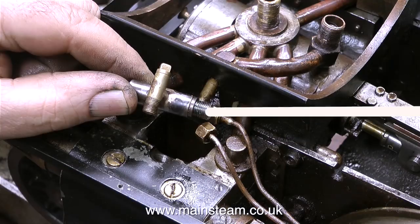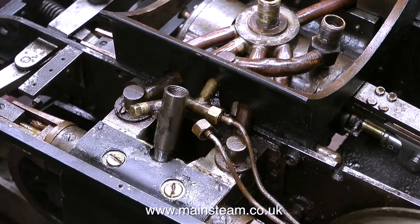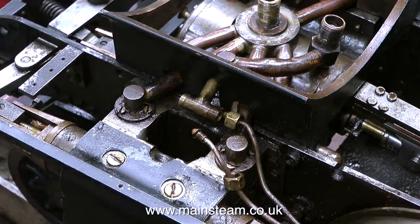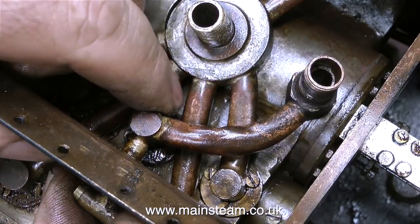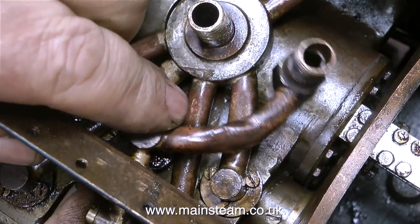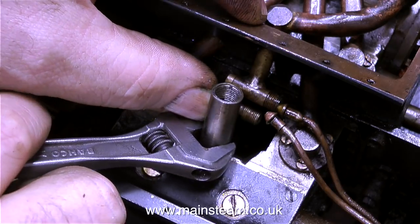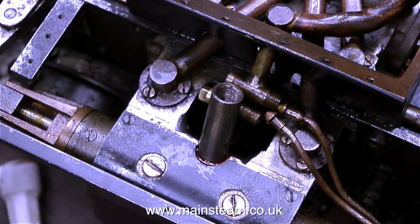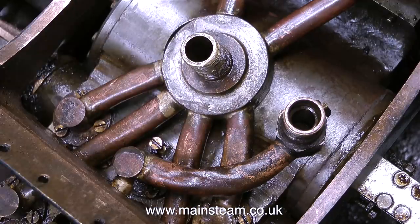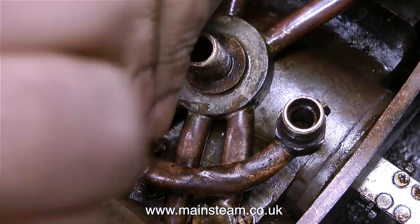So how did I repair the fitting? The original thread was a little bit on the thin side. As this part is made of stainless steel, I also made the new thread out of a piece of stainless steel. Unfortunately, to fit this new part into the cylinder, I had to remove the pipe that feeds the centre cylinder, because this was in the way. Once the centre cylinder pipe could be moved out of the way, I could get down to the serious business of fitting this new replacement part into the hole in the cylinder. Then, as assembly is the reverse of disassembly, I re-bolted the pipe to the centre cylinder back in place. This pipe is held in place with three small bolts.